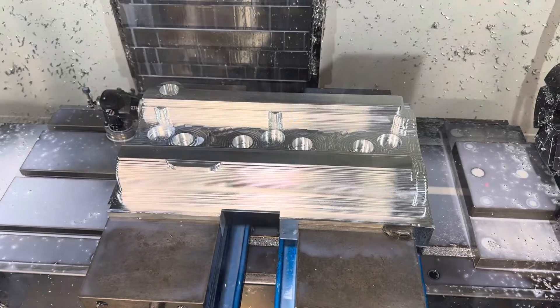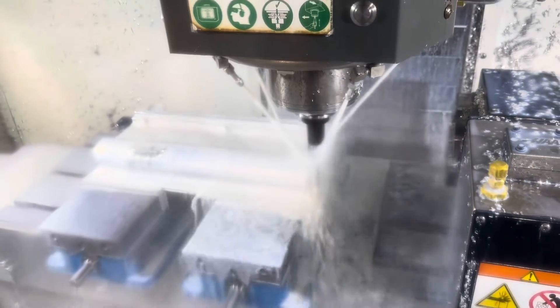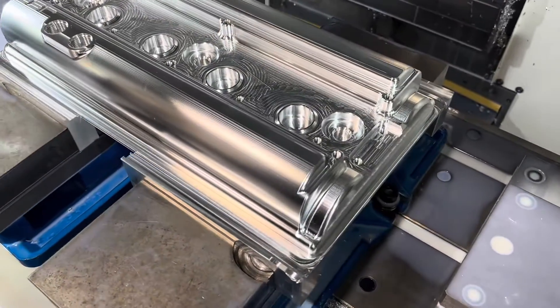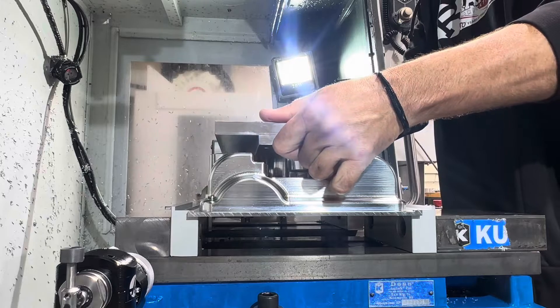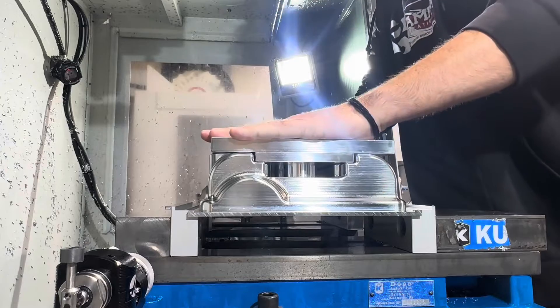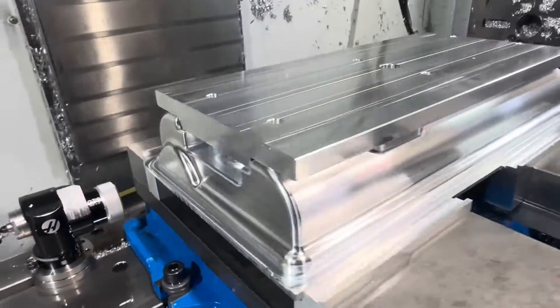You can see all of the step lines down the front and sides of the valve cover that have to be surfaced with a ball end mill. This is a 3/8" ball end mill going over the top surface to smooth it all out. After about two and a half hours of machining, the top side is completed. A quick inspection is done, and then I check the fitment of the fixture for the second operation. It was programmed to have a 1.5 thousandths slip fit into those bores and it fits nicely, so no changes are needed.